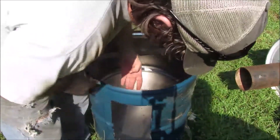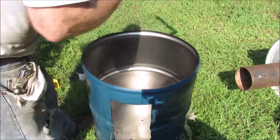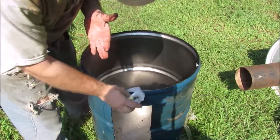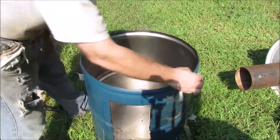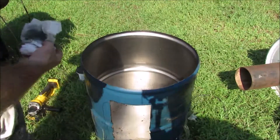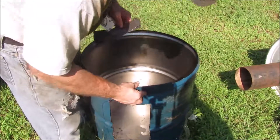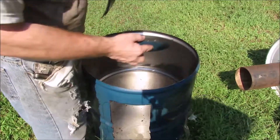Alright, I'm taking a little bit of acetone to the outside of this because the contents of this barrel are now on the outside. What's in this barrel is actually a saw lubricant from a sawmill where I work — the barrel was trash, but it's a vegetable oil-based product so it's safe. I want to cook it out of there anyway, but it's on the outside and that's going to hinder me. I'm going to take these strips and weld them to the high spots in three different places, just to act as a lip to help hold everything on.